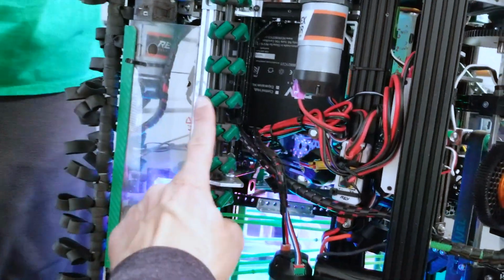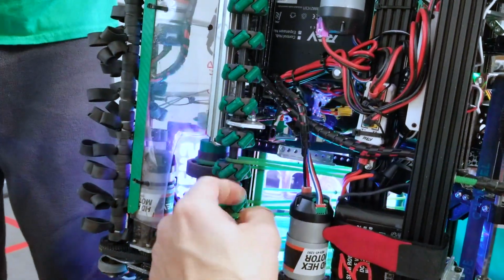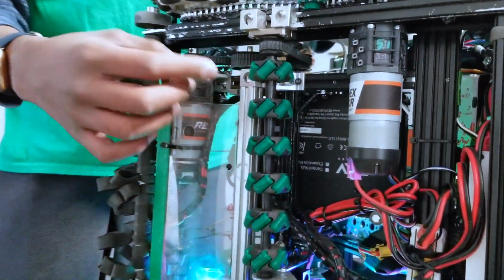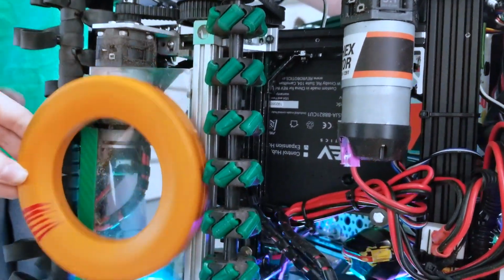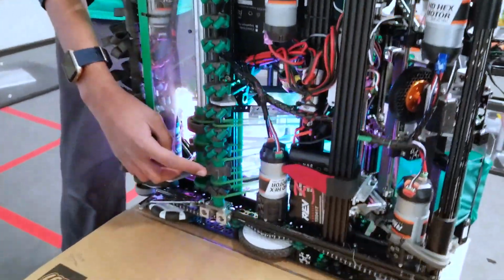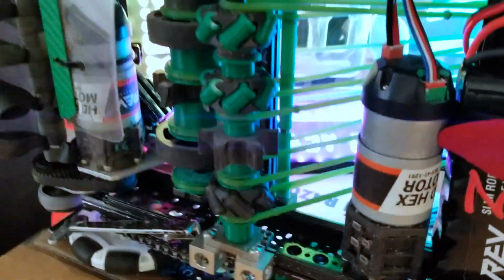And this is our battery holder. So what do you call these? You were using these for the discs? Yeah, so it's a variation of mecanum wheels. It's called vectoring wheels. And the difference is that these are more squared off than mecanum wheels. Mecanum wheels are more round. And these are perfect for moving the rings down. So when this spins, these rollers push it down this way and up into here. These traction wheels pick it up and then take it in. Cool.